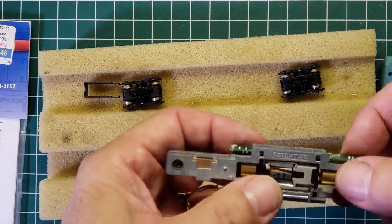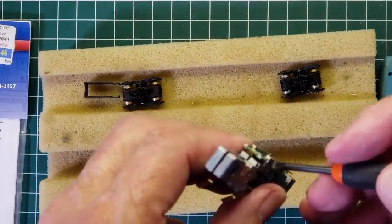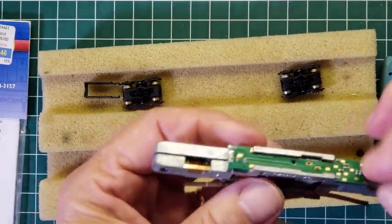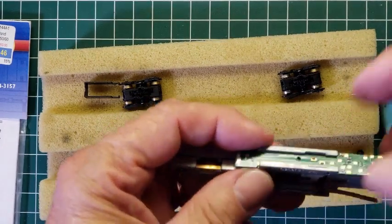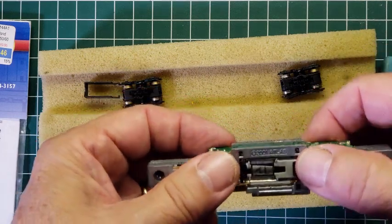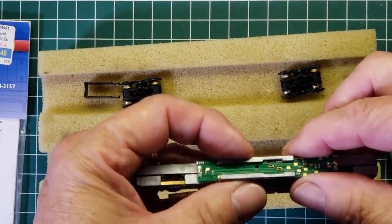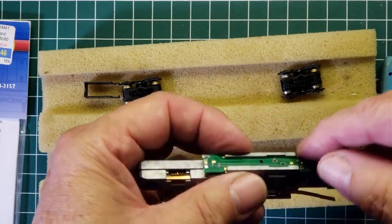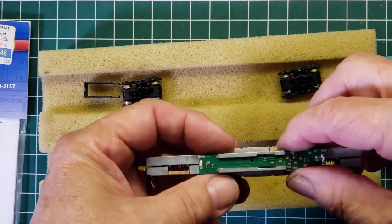the previous board in there was thicker, and so the little fingers that are molded into the metal here are not touching the sides because there's four points. And it's kind of resting in there, and it's from the bottom and the top, which means there's 8 points of contact here. Oftentimes that's not an issue, but it can be. And when it is, then we will slide little pieces of metal in there to try to get the contacts up. But this is a first shot at mechanically getting it all in there.